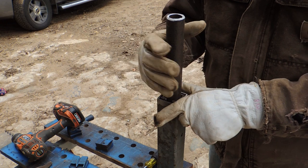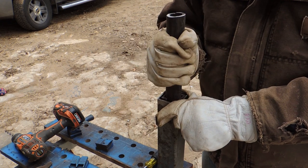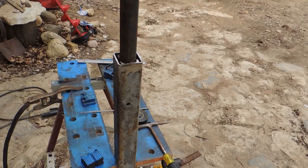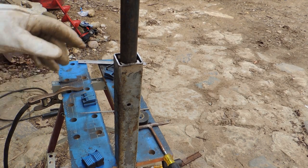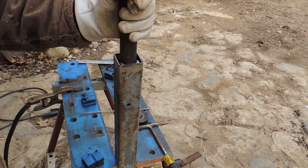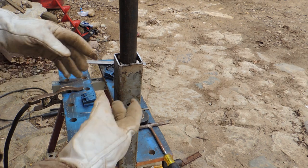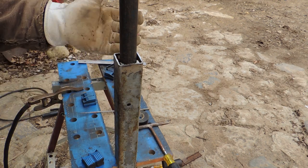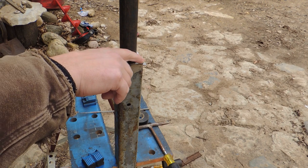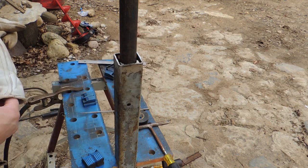The other one I'll just have to have these plates — the channels in there — looks like it'll move around just fine. Maybe put a little grease in there. It looks like it fits pretty good. I just have some electrical tape holding the halves around the piece of pipe, but I can spin this piece of pipe. I have my hole here so I could weld the channel from the inside while it actually has a piece of pipe in there, and then that's recessed a little bit so when I make my weld I'll still be able to put that big washer.